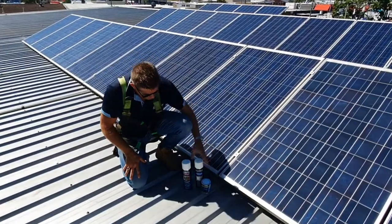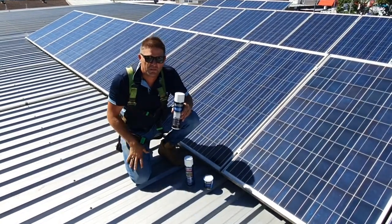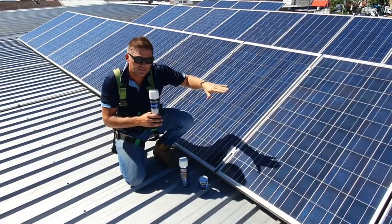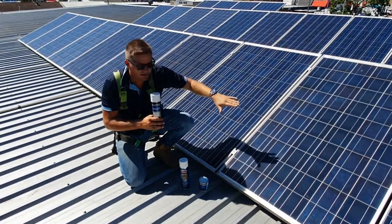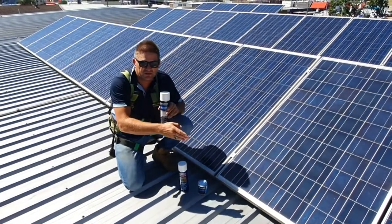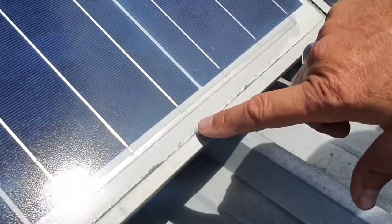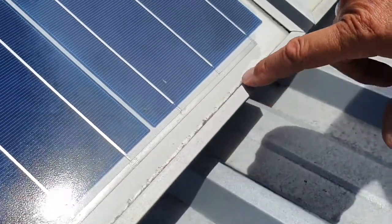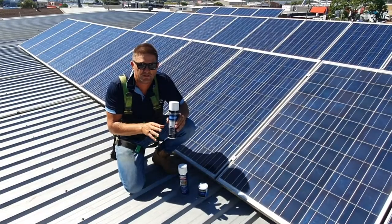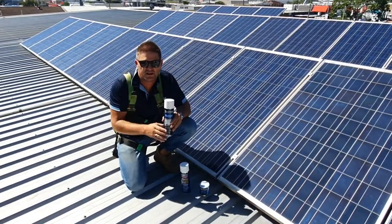The first product we're going to talk about is Glastgen. Glastgen seals the edge of laminated glass. Your solar panel has an EVA interlayer between the layers of glass and the actual solar panel material, and what this does is protect that edge and waterproof it — because if you get water within the interlayer, you'll see bubbling and delamination like you see in the corners of this panel. We recommend using Glastgen upon manufacture, before the frame goes on, and that will stop that moisture getting into the interlayer.